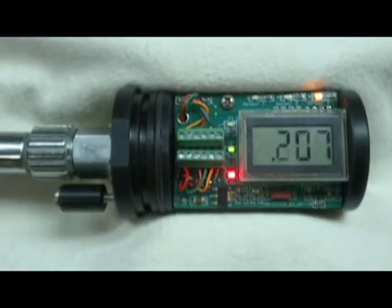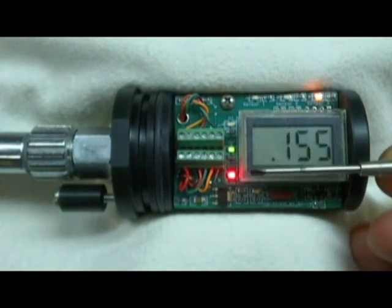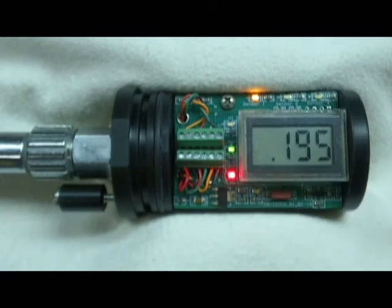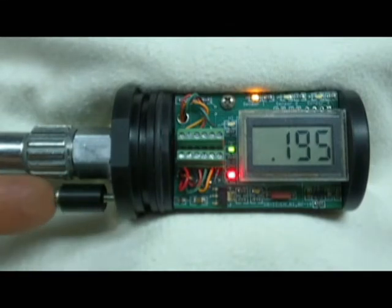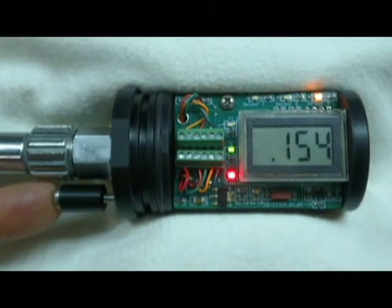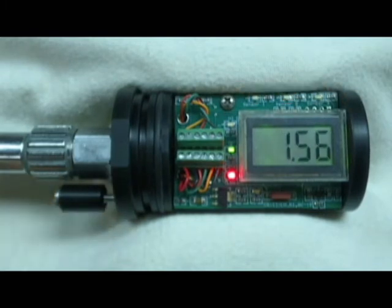The next function is calibrating our oxygen sensors. To enter this menu, we need a low PO2 alarm active. If your PO2 is above your low alarm set point, you cannot enter the sensor calibration menu. We follow the same procedure used to toggle the backlight permanently, but we wait for the amber sensor LEDs to flash a second time — press and hold, wait for the LEDs to light twice, and release on the second flash to enter the sensor calibration menu.